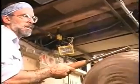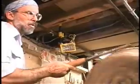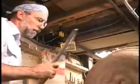An old lathe technique also is you can just lay the tool on top of your piece, and if you hear it bouncing, then you know you're not round. So I don't think we're round anywhere yet, totally round, getting close. Still hard out there on the edge.